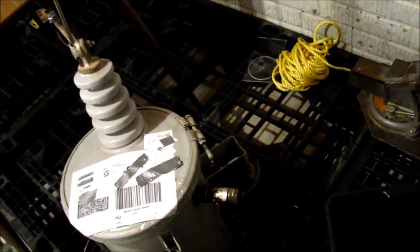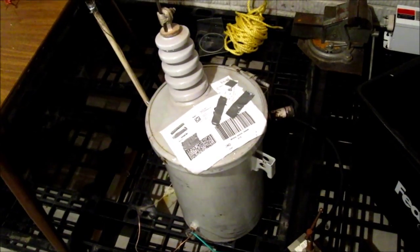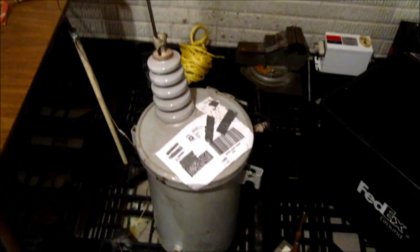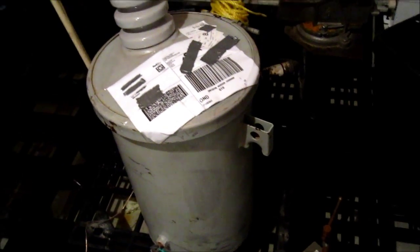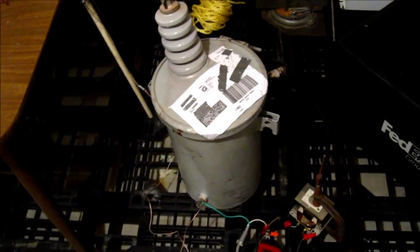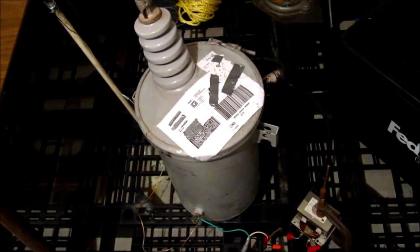What this one is actually for is it's kind of a control transformer. From what I understand, it's mounted on remote pole-mounted switchgear and other things like that — remote traffic lights, billboards, or something that requires just a small transformer. It doesn't require some 25 kVA monster to power something of low load. I've seen a lot of them around where I live on pole-mounted switchgears, reclosers, capacitor banks — things that need their own low-voltage 120-volt power to operate high-voltage gear up on the pole, but don't need a larger transformer.